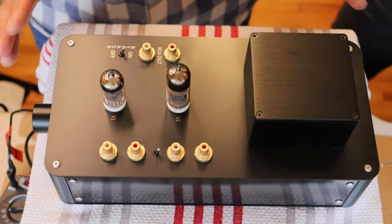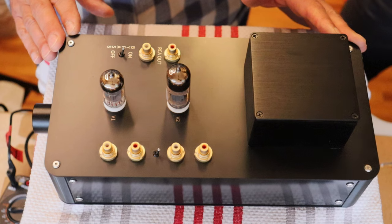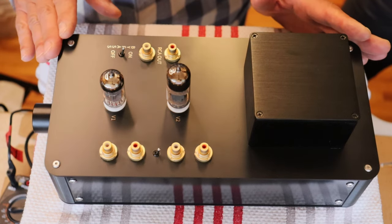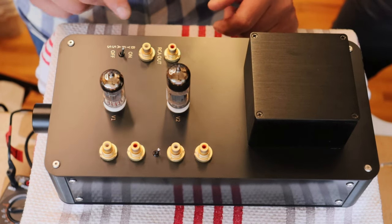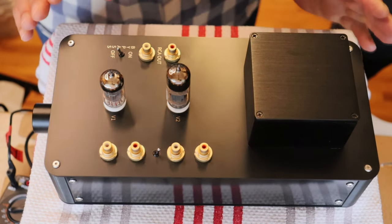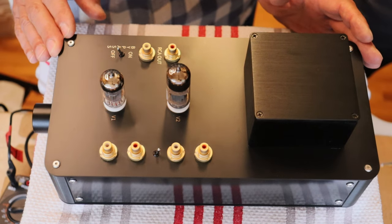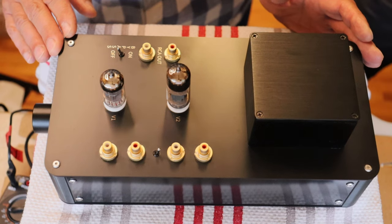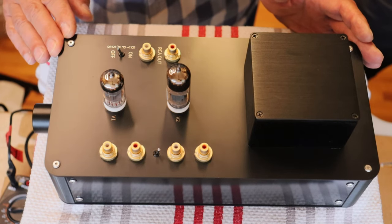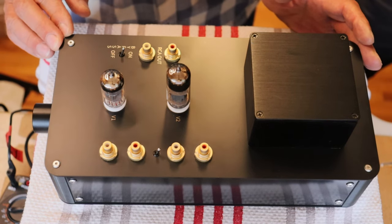And we're talking about gain. So that's another interesting thing. This has been designed to complement the rest of the line that's coming. And as a result, we needed a high gain preamp. Yep. So with the bypass off, you have a gain of about 18, if you've got a 1 volt RMS input, which is typical. So if you have a little higher gain input, of course, your gain's going to be a little higher. But with the bypass on, we go up to, I think, almost 28 volts out.